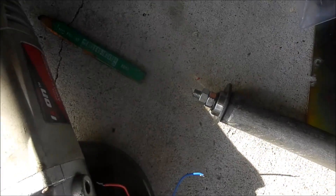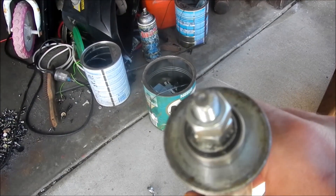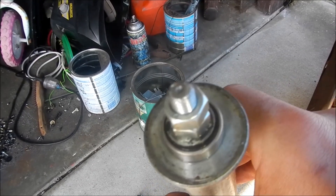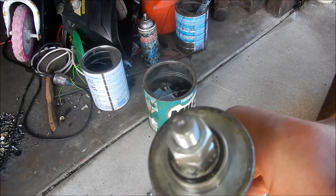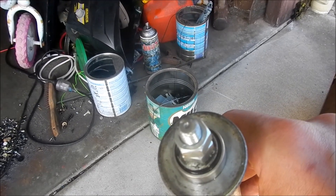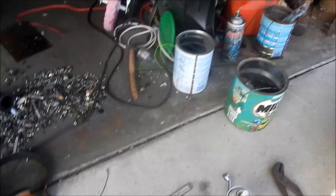It was all a bit wobbly when I was doing the drilling, so I've rigged up this bit of galvanized pipe with a threaded rod all the way along the length of it and bearings at each end — and it spins really smooth. I've already centre-holed the end of it. You can see how smooth that spins. Now I'm going to do a little bit of drilling and show you how I'm doing it. I'm not going to drill the whole thing out — it does take a good hour or so — but I'll do it for a minute or so for you.